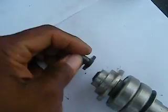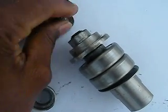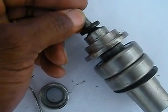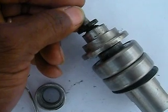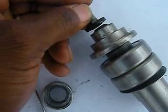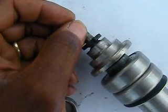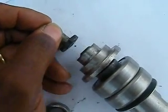So how does this work? You have the spring that applies tension to help seat this mechanical face onto the mechanical face on the shaft, and if for some reason there's imperfections in the mechanical seal faces, it's going to leak. Also, it will leak if the spring tension is not adequate, or there's some impurities between the faces. So that lifts off the seat, and then water starts leaking between that little gap there. That's exaggerated a little bit.